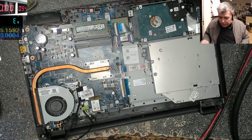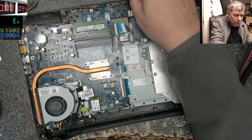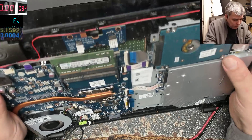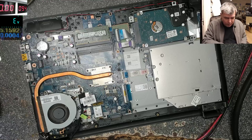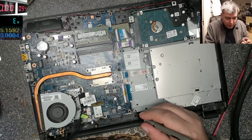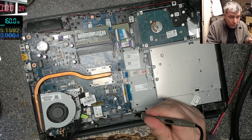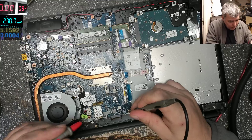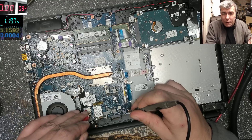Hopefully it's fine now — let me check one more time. Plug the cable in, still have the power light. Pressing the power button — and it's coming on! It's working. The middle pin voltage: I don't know if the exact value is critical, but obviously it must not be connected to plus or to ground. Measuring it now: 1.1 volts on the middle pin.